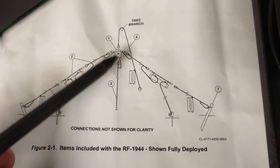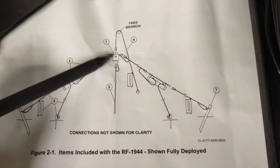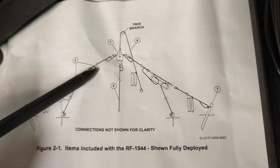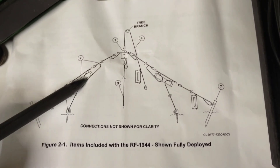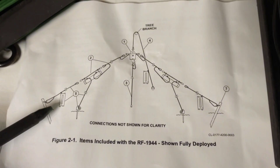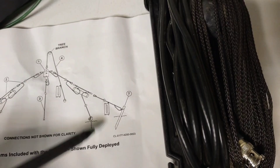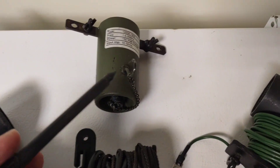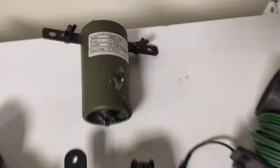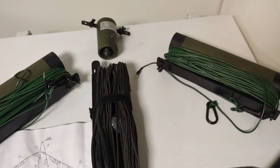This is the diagram on the instructions. Here's the balun right here — this is a weighted line that gets thrown up in a tree. You pull the balun up, and this right here is the coax BNC — everything is BNC. It goes to a line that runs to a load resistor, and that terminates to the ground. You've got to ground that, put that in the ground, and this is a stake that holds the antenna taut. The balun is again good for 1.6 to 30 megahertz at 150 watts. Here's your BNC coax, which is provided in the kit.